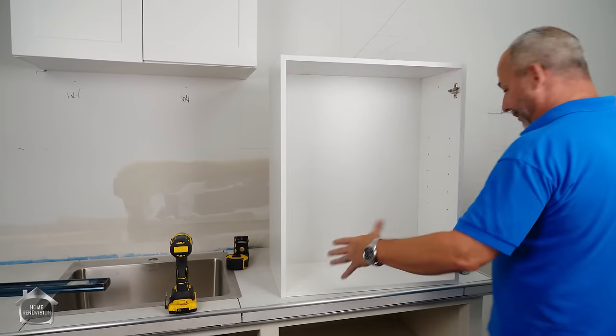One of the difficulties in doing kitchen cabinets, especially if it's a long run, like a 10-foot wall, or around the window of the kitchen and the cabinets are all continuous, is the fact that wooden structures tend to go like this. Okay? To no fault of your own. Even if you try to make your walls perfect, wood just does weird things. And so here I am with this cabinet screwed tight to the wall. This one's tight to the wall, but my cabinets aren't lining up. And it's not because they're manufactured wrong, it's because I've got obviously a stud here that's causing a hump.